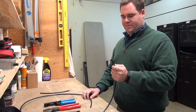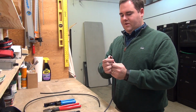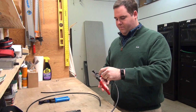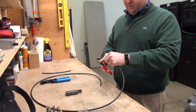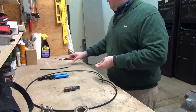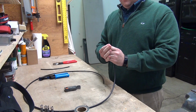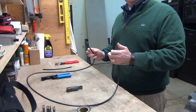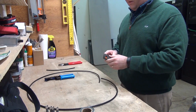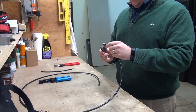So in that type of situation, normally you have cable in two pieces. Sometimes they don't look so good after they get nicked. So to start out on it, you're going to want to trim both ends to make sure they're both clean. And then we're going to use some of the other tools in this kit in order to prep the cable to put new connectors on there. So essentially what we're doing is that we're going to put a splice into this cable in order to reestablish that connection. So we're going to take our cable strippers and we're going to prep both ends.